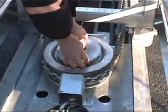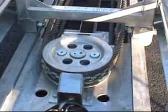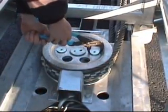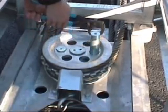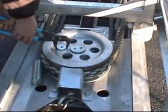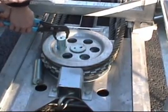Remove the cover plates on the cylinder sheave assemblies. When you take the covers off, you will see the two outer anti-rotation pins, and you will need to remove them. The center pin stays in because it holds the sheaves in place and allows them to rotate.